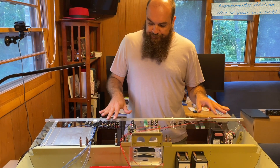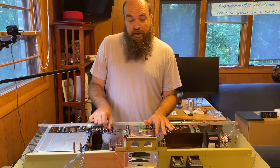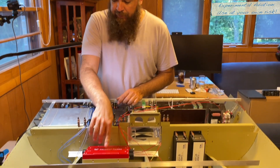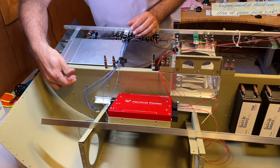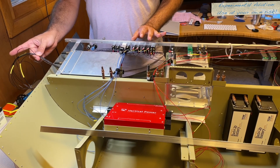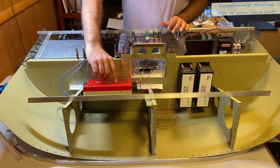You can see there are a couple of different colors of wire right now — there are blue ones, some red ones, and some black ones going in different directions. The blue ones I decided are going to be switches, so any switch gets a blue wire. Black wires are of course our grounds and red wires are power wires. A lot of the switches go to the vertical power of the BPX unit. The grounds are all getting ground on the panel on the backside — it's just a forest of tabs — and all the grounds are going to go there. I haven't terminated the ends of a lot of these because we're still figuring out the perfect routing and I want to comb the wire bundles to make them nice and neat.